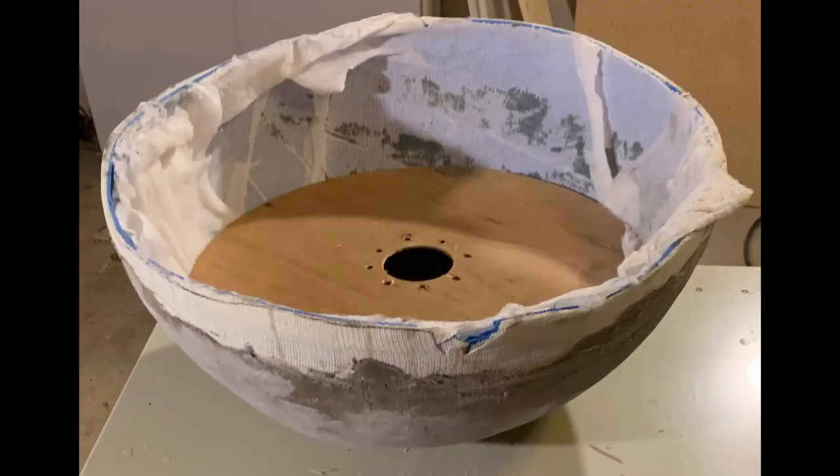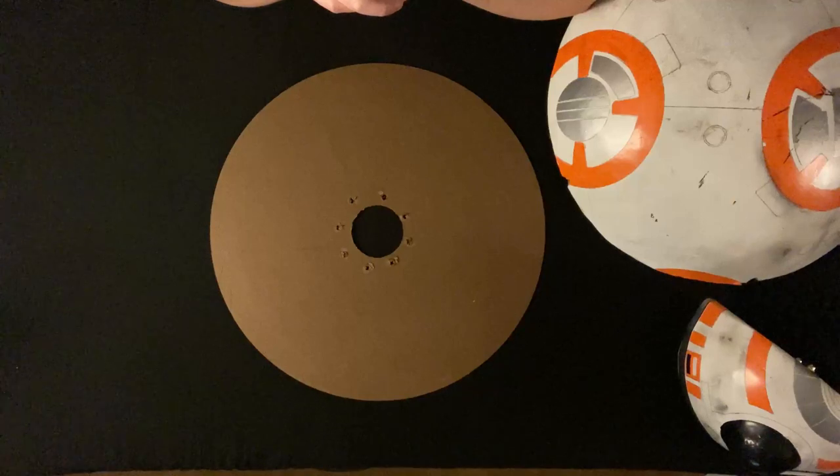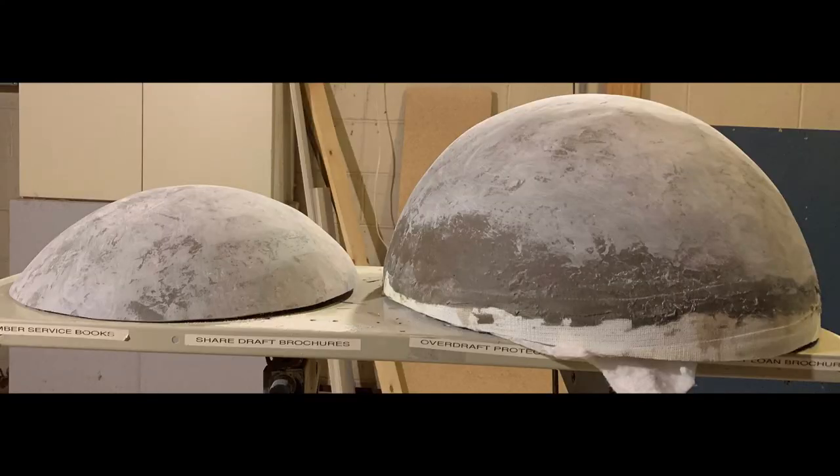I ended up sealing the inside with tape as the uncured resin had an odor. Make sure you do a better job than I did following the directions on mixing. Once I had the dome shaped, I grabbed an 18-inch disc — similar to one I'd previously used to make wheel covers — and used it as a guide to mark the inside of the domes. This gave me a line to cut so I ended up with an 18-inch diameter base while maintaining that 6-inch height. My not-so-pro tip: I realized I should have done this step before putting the fiberglass resin on — even drilling reference holes to know where to stop the coating would have saved a lot of resin and time. Here you can see a comparison of the final dome size next to the original.